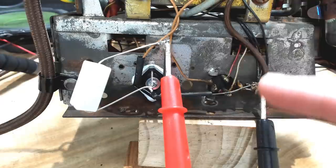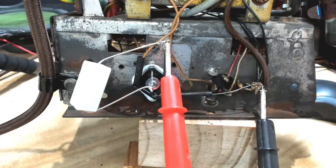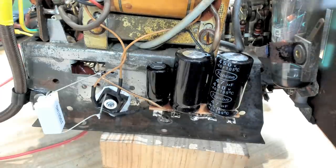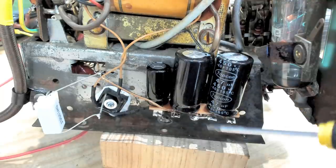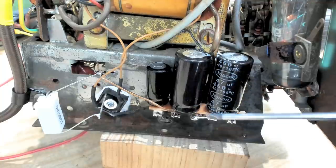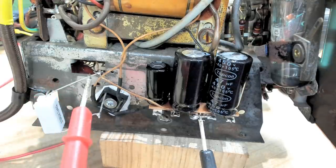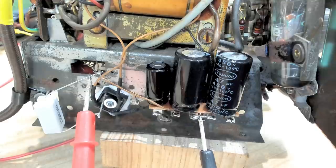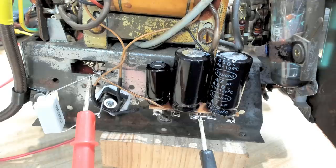Having said that, I'm going to change this filter capacitor - there's a fair bit of hum, plus it's an old capacitor. I'll put a couple of electrolytics, take this one out and mount them underneath on a tag strip. After mounting three capacitors on the outside, I checked the old capacitor and it was way out - gaining at least 30%. With the new caps in there's absolutely no hum now, it was humming quite badly before. The voltage is 280 with 240 going in - for a B+, I'm happy with that.